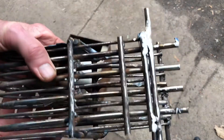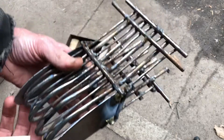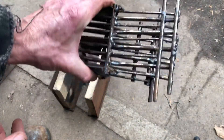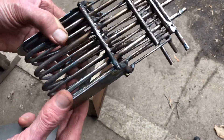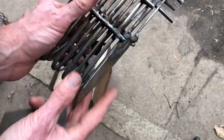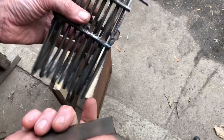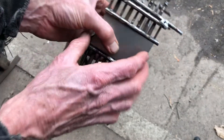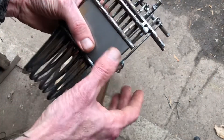Here I've got a pellet burner I made — my second pellet burner. I tried it out on a new rocket stove I'm putting together from parts I've had, and it was amazingly hot — worked really well, actually too well. It needs to be toned down a little bit. One problem was the pellets were coming out the sides; these gaps might be too big. I've covered up the sides now, and the next thing I'm going to do is put a plate right here so the fire going that way won't heat the pellets more than it should.